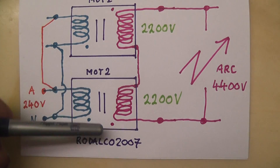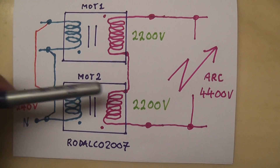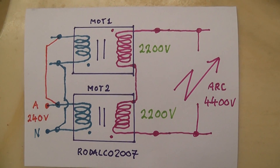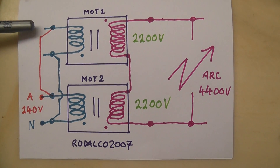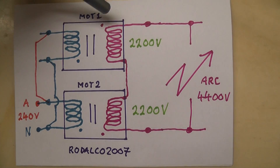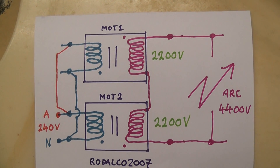From the steel frame to the steel frame the opposite way — 2200 volts plus 2200 volts. You sum them up and you get 4400 volts. If you've got floating terminals, you may have to swap the wires around on one of these two, so you need to make the secondary HV coils additive so they both add up. They need to be in phase — and the primary coils are in phase.